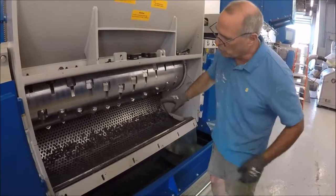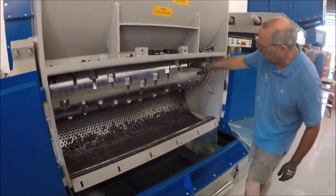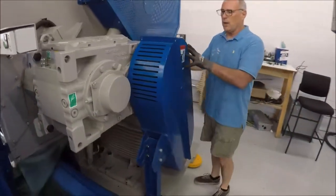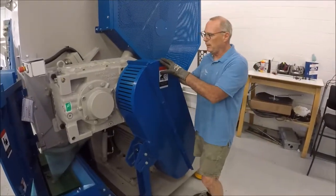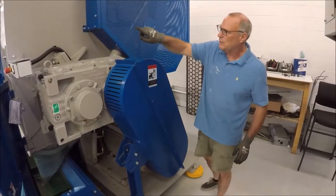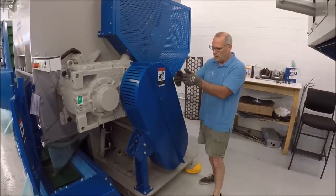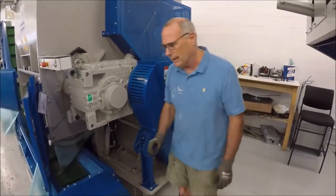In order to turn the rotor — because this rotor right now only gives you access to about eight knives — you undo the guard belt on the side, which allows you to get to the hydraulic belts. You just pull them, and when you pull them it rotates the rotor, which gives you access to another set of knives as you go through it. So you pull this off, pulling them down, rotating the rotor, and it gives you access to another set of knives.